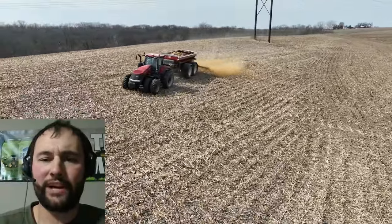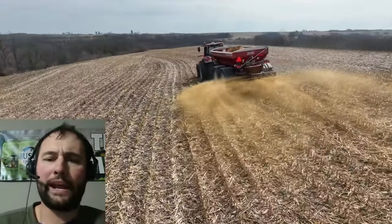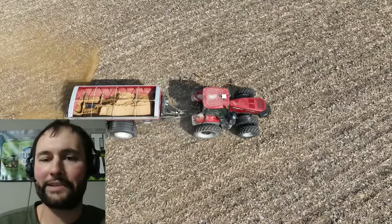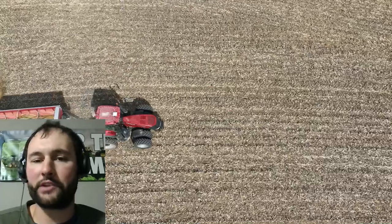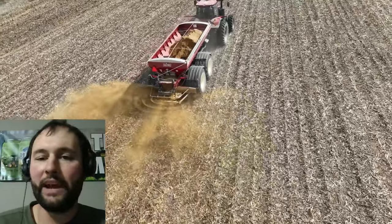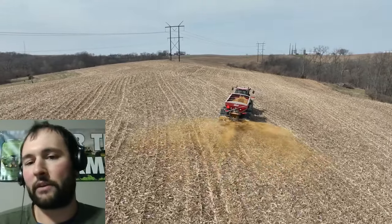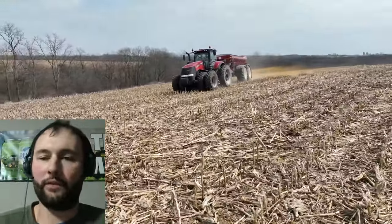With the drone you can see it's a little biased towards downhill right now — we are on a side slope, about three-plus degrees. It kind of just biases it downhill a little bit. You can see the heavy stream right behind the right side of the spreader as well as on the downhill side. It is putting material across the full 60 feet, just a little heavy in one stream. I was still putting on enough material — with lime, I don't think it matters a whole lot. It's tough to be perfect with a drop spreader.